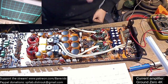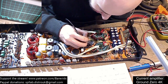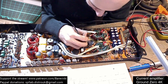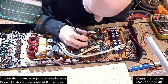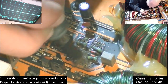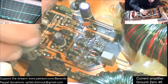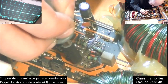Power supply off. What I'm going to do is actually dig out some of this carbonized burnt section of the board here, then spray it with isopropyl alcohol, and see whether the carbonized conductive sections were just on the top layer. By scratching the carbonized areas away it might resolve that. I'm just starting to scratch away a lot of this carbonized material - you can see how badly this has been burnt by how much is coming off. A good section of board should be completely solid, but this is soft and fluffy because it's been really badly damaged by the heat.